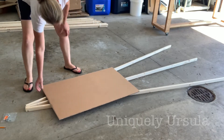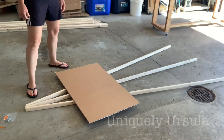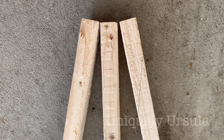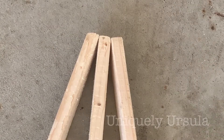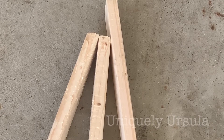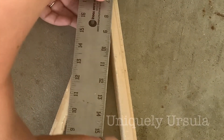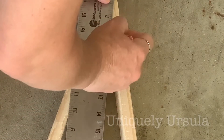I took a few minutes to lay out various sizes, signs, and configurations just to determine what angles I would want my easels to have — that's something that can be adjusted to your needs as well. Once you have the angles the way you like it, carefully take one of the side pieces of wood and push it straight forward. Then place a straight edge on that center 90-degree piece of wood and draw a line straight up on your side piece — that is your cut line.